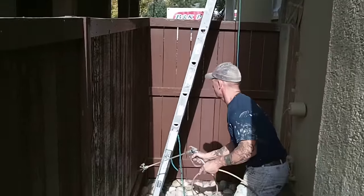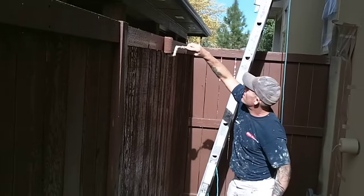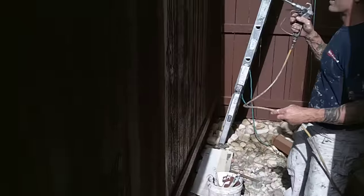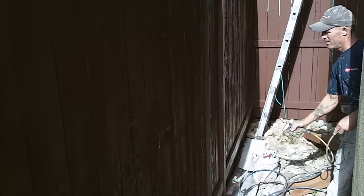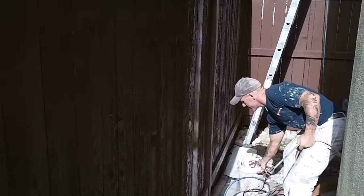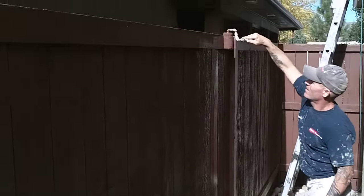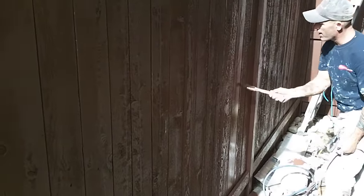Go back the opposite direction. We're using a four inch nap to back brush the top. We're going to back brush this bottom piece right here, and get around the post. We're going to have a tight space where it's a small alleyway. As you gain more experience spraying, you can release the trigger — by releasing the trigger it actually saves product. Back brush and back roll the post. Any places that look dry, or smooth boards that could possibly run, we back brush them.